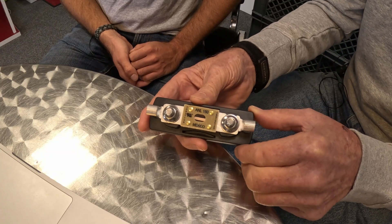There's quite a bit to unpack here. We've got a 150 amp ANL fuse here to give you an example of what they look like. A fuse is a thermal device, so if it's running at close to its rated amp rating it's going to get hot, because it's got to get hot in order to melt and blow. So yes, it's perfectly normal for these fuses to get pretty hot if you're running them close to their fuse rating, which it sounds like he is. It's in his charging circuits — he's probably got lithium-ion batteries and a powerful alternator, with the circuit running close to its rated ampacity for an extended period of time.